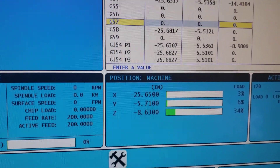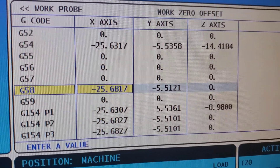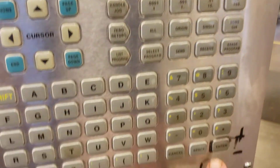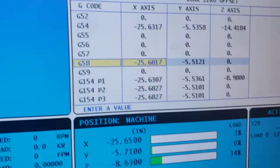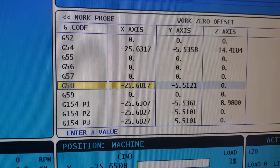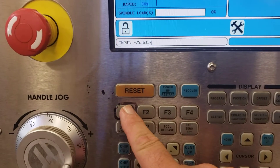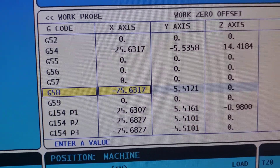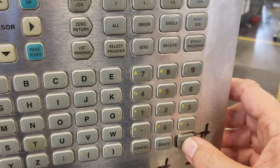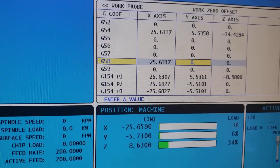Tips and tricks: make a copy of the number before you adjust so you have a backup plan. Note that the add and subtract button will add to the existing number — it won't overtype it. If you want to force a specific value, type in the number you want — for example, minus 25.6317 — and press the F1 force button. It sets exactly the number you want. Same thing if you want zero: you can't use the add/subtract button because it'll add zero to it. Type zero and press F1. That's all you need to know.